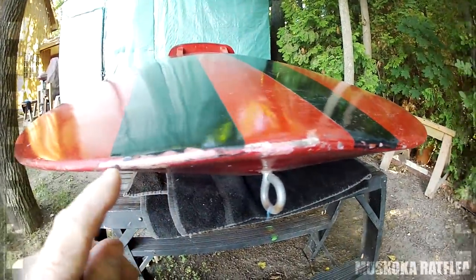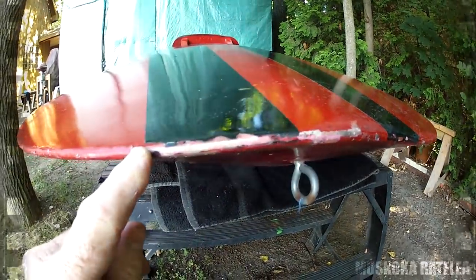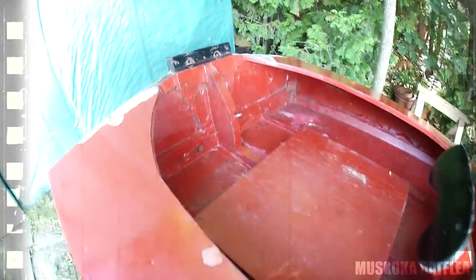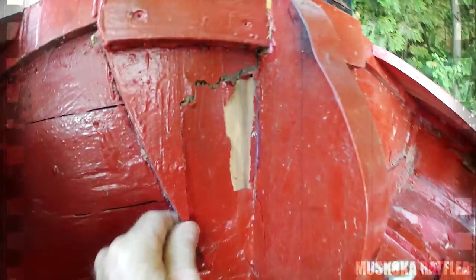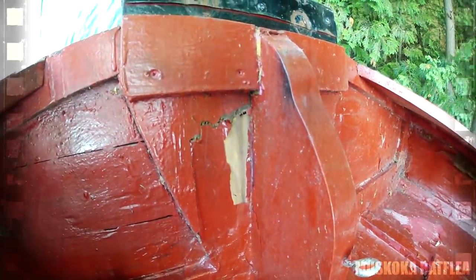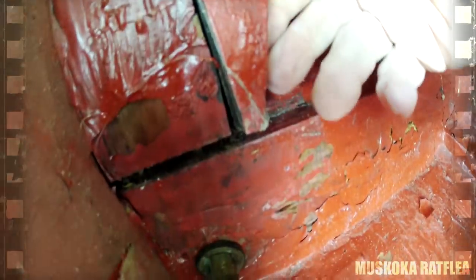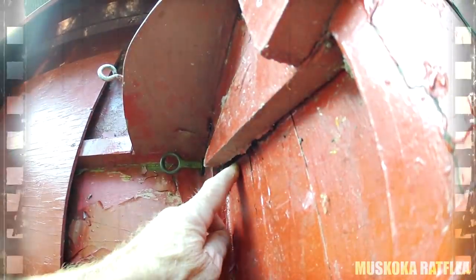What's interesting is there seems to be fiberglass cloth applied to the entire surface of this boat. However, I believe this boat was left out in the elements, because if we inspect the transom area you can notice there's some major work that has to be redone. The actual motorboard seems to have cracked away from the transom area and right here there's a big crack. Getting in closer, you can see it's come apart from the transom as well. Going to the back, you can actually see right through the transom - it looks like it was built up with one-by-four pine, but it'll probably leak.